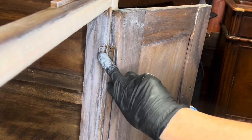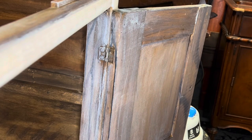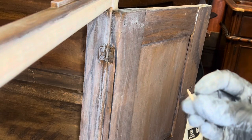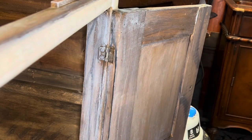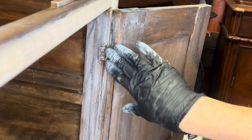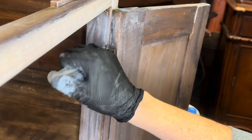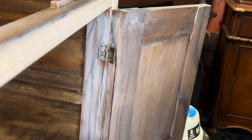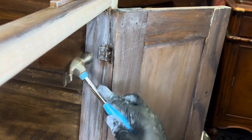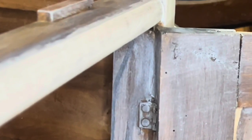Since I do want to keep the original nails I could put screws in and it would fix everything, but when it's like this I like to kind of keep the originality of what's going on. So we're going to try the old toothpick method. A lot of times if screw holes are stripped out you can add a toothpick in with some wood glue and then put a screw in. I'm going to try that with a nail and see if I can get that to tighten it up. I'm using my knee to hold up the door and keep it pushed in while I'm hammering, and I'm using one of these guys to help me out.